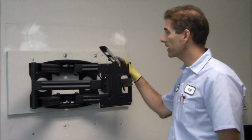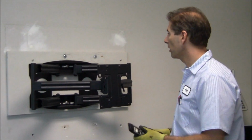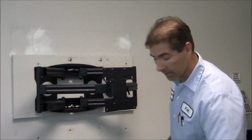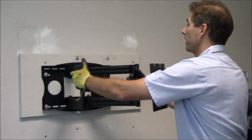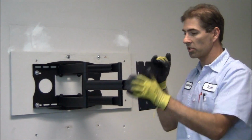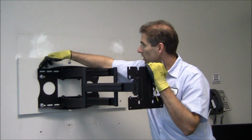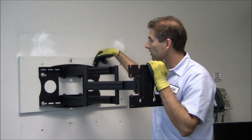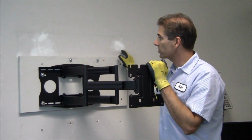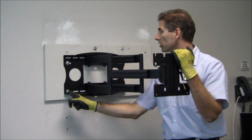Okay, now you can see the TV mount on the wall. You can see that this particular one can articulate out, so there's a great stress that's placed upon this once the TV is put way over here at this end. This is only 18 inches from here to here. The studs are 24 inches. So I've grabbed the stud here and here with my toggle.